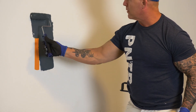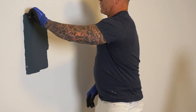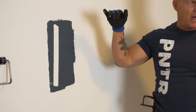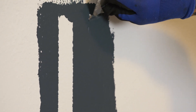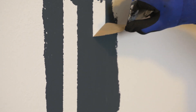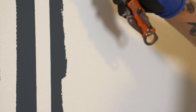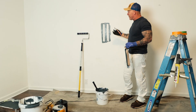The uncaulked one — you can see paint because we got all these peaks and valleys. Paint bled underneath that tape all over the place. Now peeling off this Frog Tape — you can see the difference in why we actually use caulking. You got a little bit of bleeding right there because I didn't get some caulking right there at the top, and you can see this side right here: a laser-sharp line using caulking.